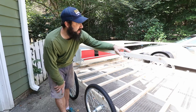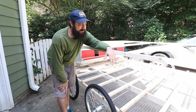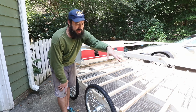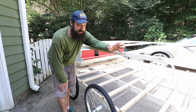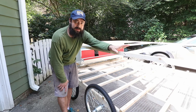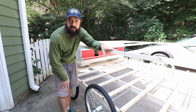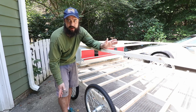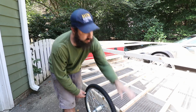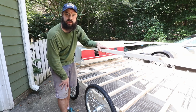I got the roof supports in. The Chickshaw has a hatched roof which I frankly never use — it's a good idea for a smaller coop but I literally never go in there. One of the reasons I used to open it was to fill up amendments like grit and calcium, but I have a different setup for that now. So I'm going to make the roof not removable. I designed it at this height because I bought 8-foot PVC roof panels for the top and sides. I wanted to divide them into thirds — which is 32 inches — for the side height, to minimize materials for weight and cost. So it's 8 feet by 10 feet, 32 inches tall top to bottom.